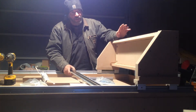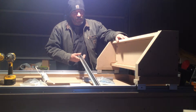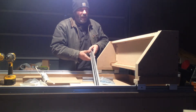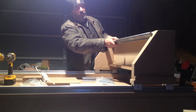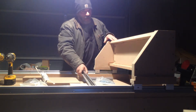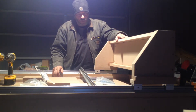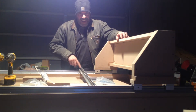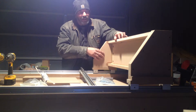The problem I have here — I forget the exact measurement converted to inches, but it was like 59/64ths. I went to the full inch. The problem I'm having now is I'm a sixteenth of an inch too narrow to fit my rails in. I figured going to the full inch would give me enough room, but I took my tape measure out, double-checked the conversion, and they are actually a sixteenth over. I only had about a sixteenth inch of play in here.